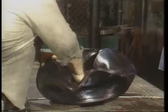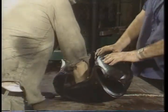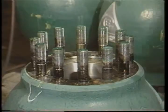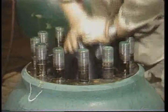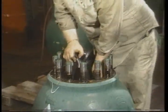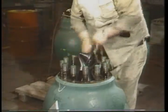The other method is to collapse the diaphragm at the center and fold the largest part in on itself. Roll it tightly together and put the bottom end into the neck of the dampener. You can use a rope to hold it tight when you're inserting it. Just remember to remove the rope.